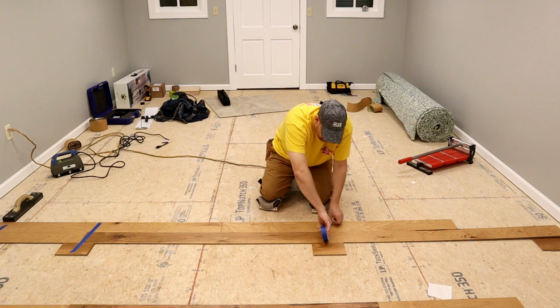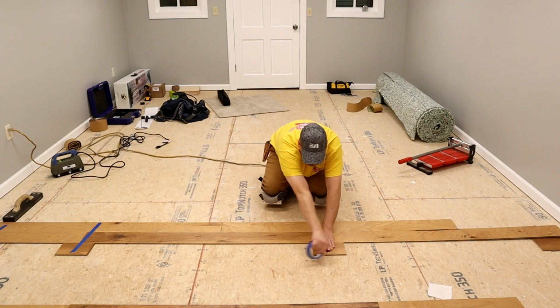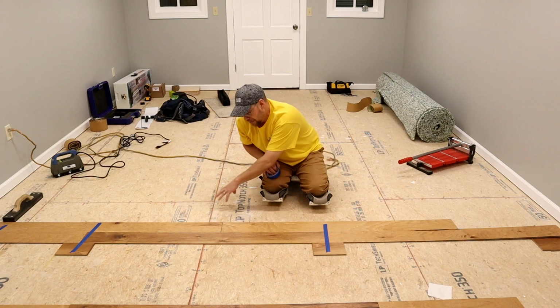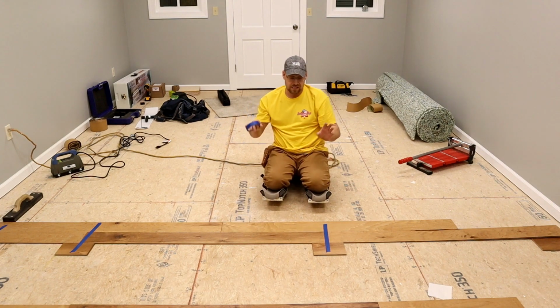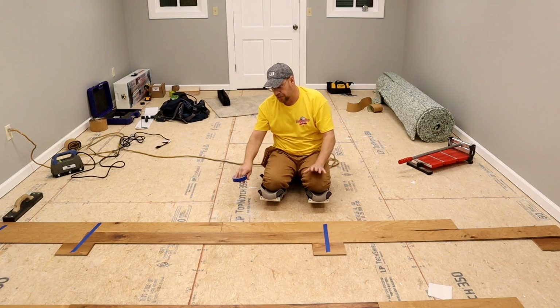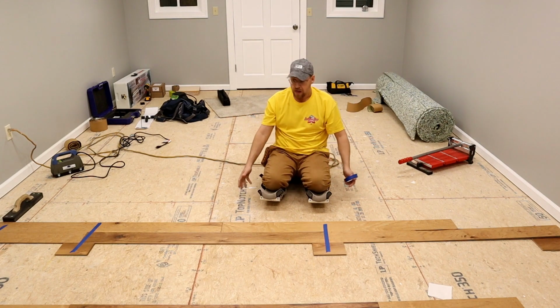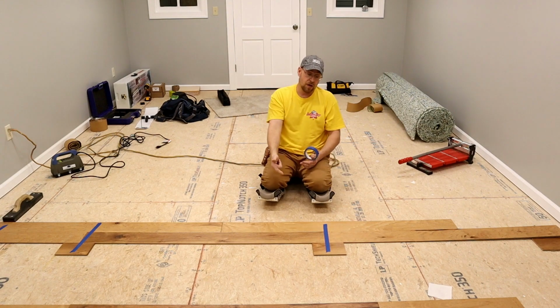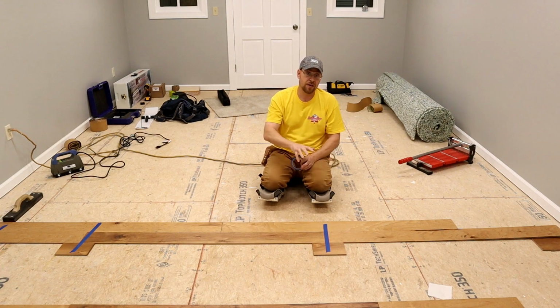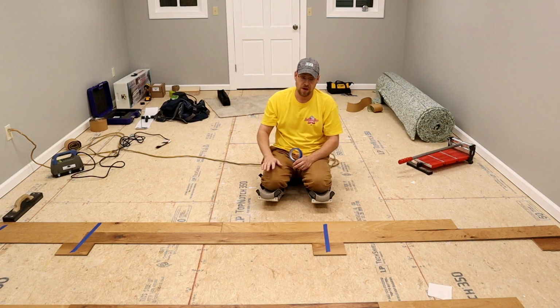And after this starting point, I don't have anything else to worry about. I can just glue, take my boards next time and tape to this run. I don't have anything else to worry about because I've got this settled, secured to the floor and ready to go, okay? So that's how you can use the Cool Glide seam system to get your hardwood glue down job started to the floor without any issues whatsoever.